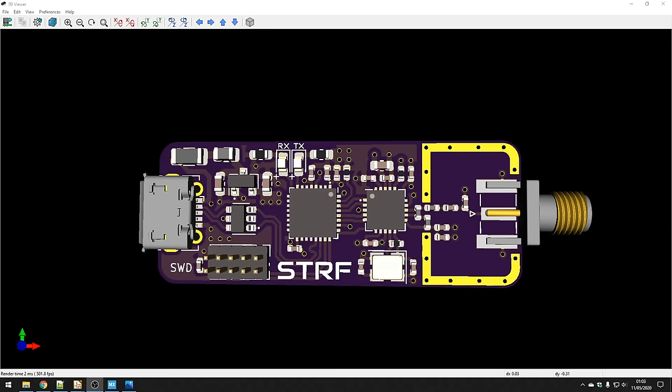This is a design I've been working on, which I think would be quite interesting to look at together. It incorporates an STM32 microcontroller, an RF transceiver and antenna interface, as well as a USB full-speed interface. The design requires a bit more attention due to the high-speed signalling on the PCB, and lets us explore more advanced circuit design and PCB layout topics.